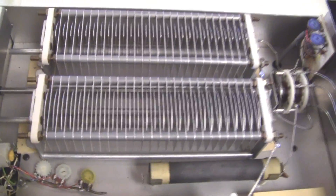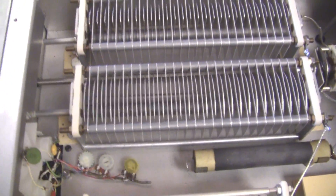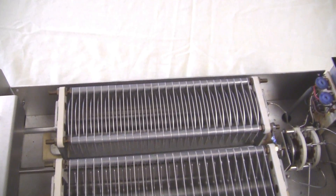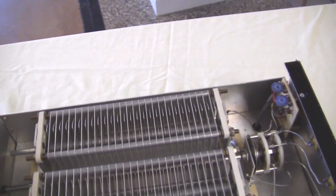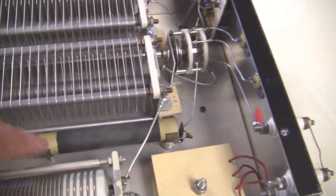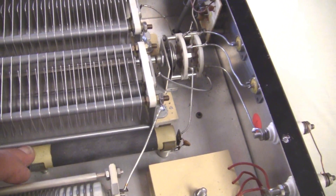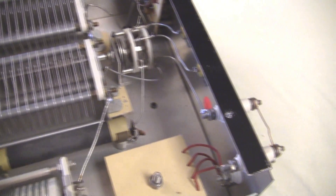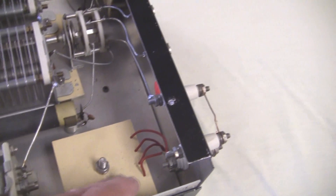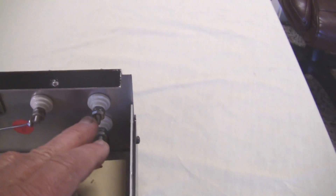The two capacitors are nice-sized capacitors. Here's the antenna capacitor and the one they've labeled the transmitting capacitor. And here's the dummy load — you wouldn't put much power in this for very long, but it is a 50-ohm dummy load, so under low power you can test a transceiver. And down below this is your balun and the connections here on the back panel to the single wire and the balanced wire.